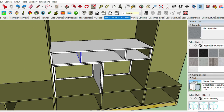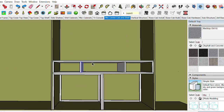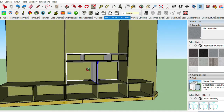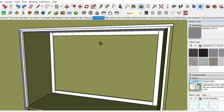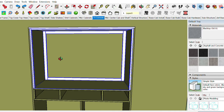My intention was to have space for my Xbox here and enough storage for controllers, games, DVDs, and whatnot. This would be way too much space for one big drawer, so it's divided by two — a section here and a section here. This also creates a really good sturdy strength piece to support whatever load I put right there. For the TV area, since I already had the two side pieces in, the top piece was able to come right on top — but I do install the resting cleat there first.